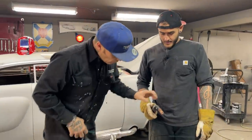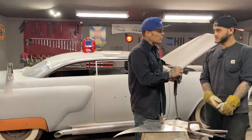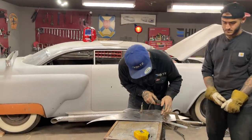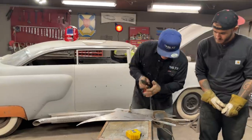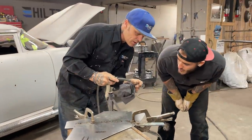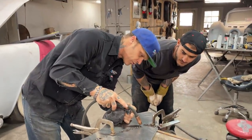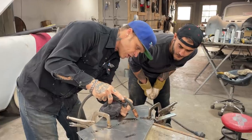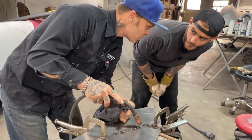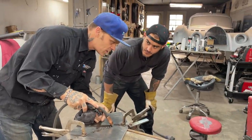Okay. So when you have the helmet on and your wire's not out exactly where you want, like not out far enough, basically what we're doing is we're making sure that the wire is... See where that wire is a little shy there? I would like to have it out a little bit longer to keep your welder a little further away. See? When you have your helmet on, you can make that adjustment before you start. You know what I mean? You're welding this blindfolded because your wire is exactly where it needs to be.